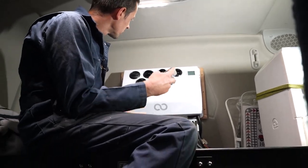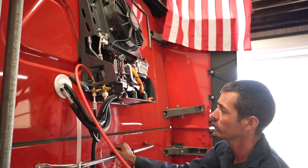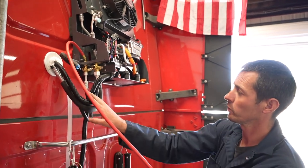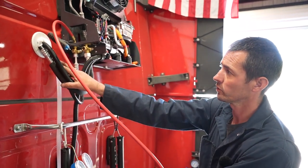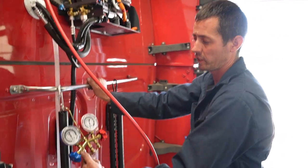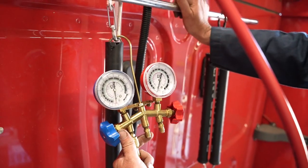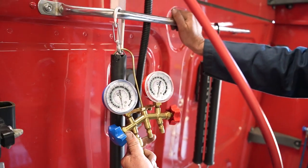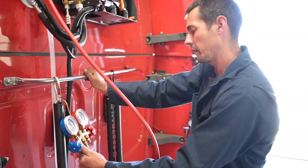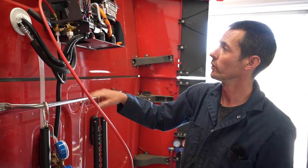We're gonna go ahead and hit the power button here and see what happens. We've got our outside and inside units installed. I had to shorten the wiring harness and also the AC hoses — had to do a little crimping operation. We've had a vacuum on this for about two or three hours now. It's held pretty solid at 22 inches HG, pretty stable. Nothing's leaking, so that's how we leak test these lines and the inside unit.